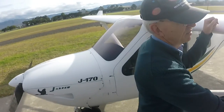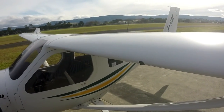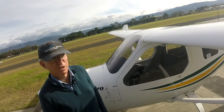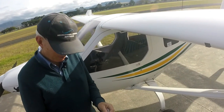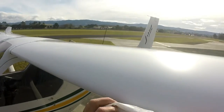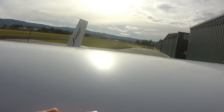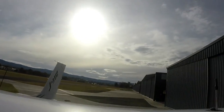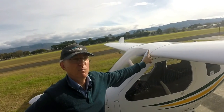There's one other thing on this wing — the stall warning. Does it work on air flow? It works on a reduction in pressure — actually works on suction. Use a piece of tissue over it. You should be able to breathe through it. Blow into it — can't hear any noise. Suck on it now, so you're creating negative pressure. Did you hear that noise? That's the stall warning. You can see it's working properly. It's caused by air flowing out of it, not into it. At a high angle of attack, you get the low pressure area from the top of the wing coming right down to here, and the airflow will start to flow out of the cabin and out here. The little horn inside the cabin — when you blow into it it doesn't make a noise, but when the airflow comes back through it, that's when it triggers.